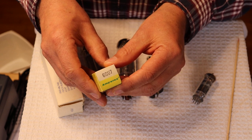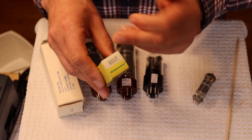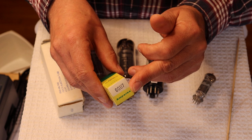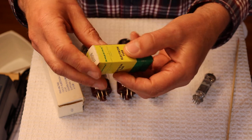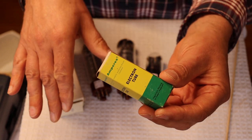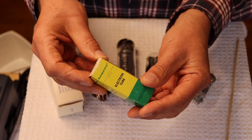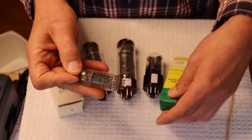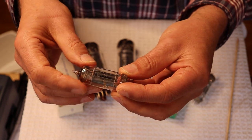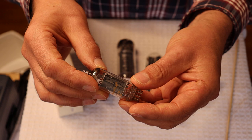Once you have an adapter, you've got it for any 6GU7. We got a whole bunch of these in, and they were labeled Amperex. I thought, well, the Europeans didn't make the 6GU7 — they didn't make an equivalent to it. Amperex, of course, is owned by Philips — "a North American Philips company." So Amperex was their North American division for selling tubes in the US and Canada. A lot of Philips tubes I get are actually rebranded Amperex. I was curious right away — what is in this wonderful Amperex box? Well, if you look at the tubes, Charles is away; this is his specialty. He would have looked at it and in a split second known: those dots — that is a GE.